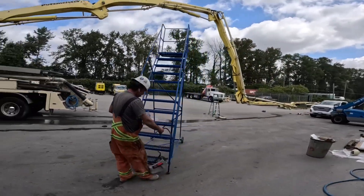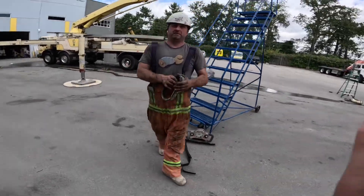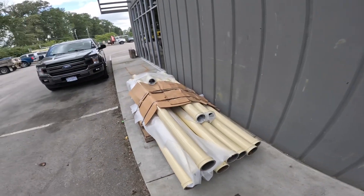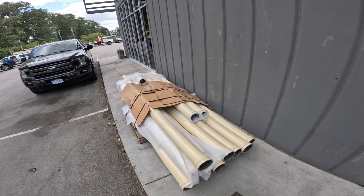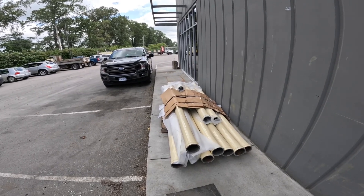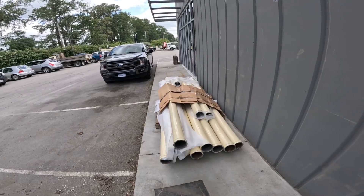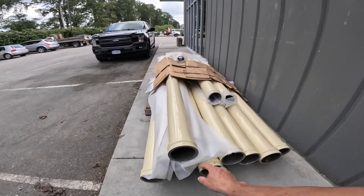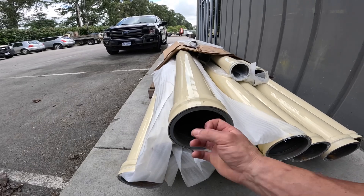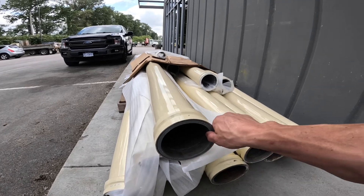Great news — the roof of your cab is spotless. Bad news — your remote's broken. We actually have another pipe kit here going on our 39-meter. We're doing just the pipes, not the elbows — the twin wall elbows on it are still in great shape. The pipes had some interesting wear at the ends: right where the insert meets the pipe, the first half inch, the liner was peeling off.